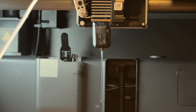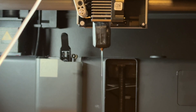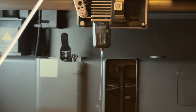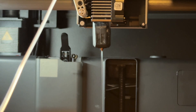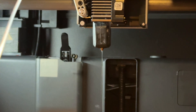Now is the important part. Notice how the filament is coming out without curling — this is a good sign. If you don't see any filament coming out or it's curling, you'll need to use a needle to unclog the nozzle. Carefully insert it from the bottom of the nozzle — imagine you are clearing a blockage. Repeat that process until you get a nice flow. I didn't need to do that in this case, but if you're having trouble, please leave a comment.